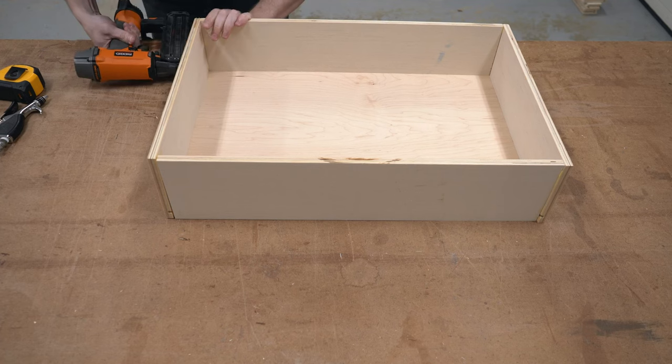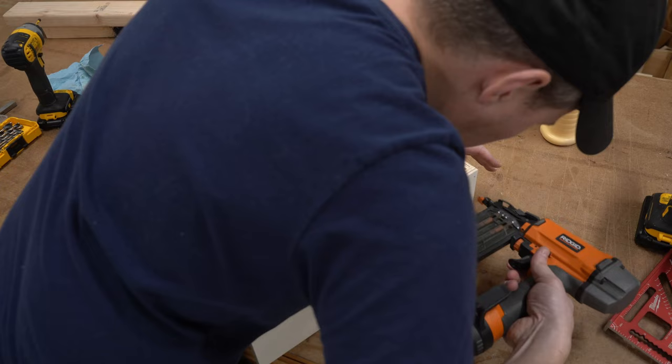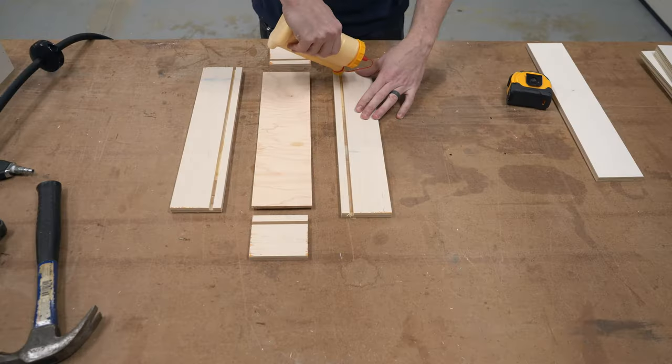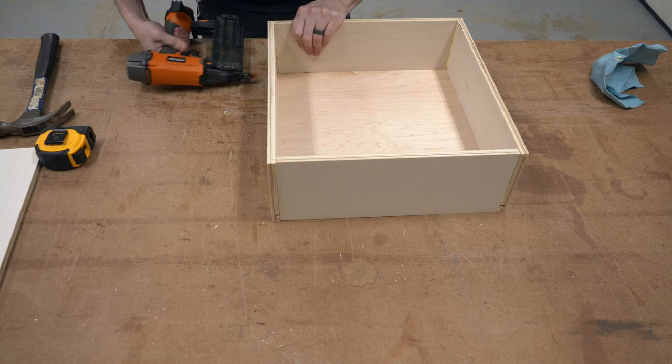The drawers were all three very unique. The middle one was just normal. The top, I had to cut out the back part of the center for the dust collection hose to come back through. And the bottom one had this weird shape to accommodate for the casters being recessed. Once these were made, I could mount the drawer slides and get them in place.